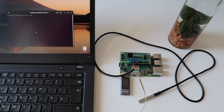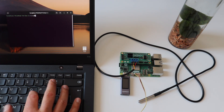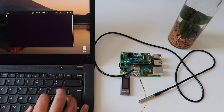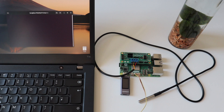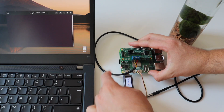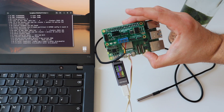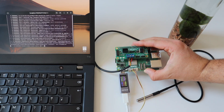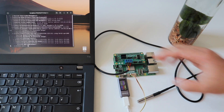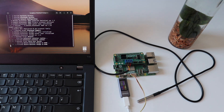It's time for the demonstrations. Let's start with a simple one: how to read the temperature. I have Ubuntu 24.04 on this laptop — the same version as on my build machine. In the terminal I typed 'sudo screen' — screen is a command-line application for serial communication, used to establish a serial link between the laptop and the Raspberry Pi 5. On the Raspberry Pi 5 I'm running core-image-base with enabled One Wire communication, based on Yocto release Scarthgap.